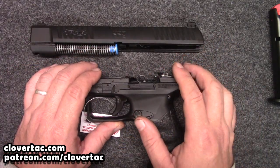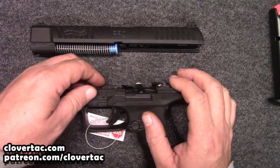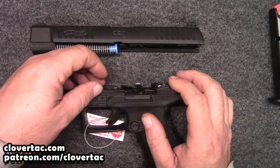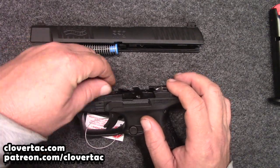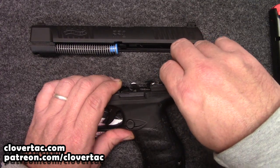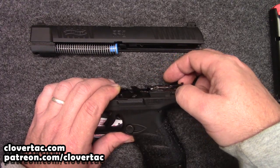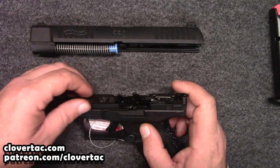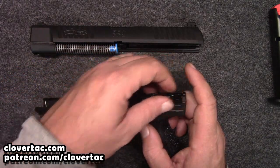We're fixing to set it to the side. We don't need it, but if you feel around the top middle area of the grip frame, you'll notice you've got a little area on both sides of the grip frame that is raised and has a little channel or a little groove. If you feel toward the back of the grip frame, you also have a little area that has a little channel and a groove. Now, this is going to be important when we're going back together to make sure that we line that slide up and get it in both sets of those channels.